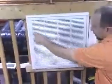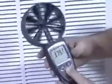Next step is to actually measure the open area of the grill. This grill is 19 and a half by 19 and a half inches. What we want to measure is the opening of the grill — not the whole exterior, just the opening that we're going to traverse. So using a calculator, 19.5 times 19.5 is 380.2 square inches. Using the up and down arrow keys I'll run this up to 380.2, and then press the hold key again to lock that in.